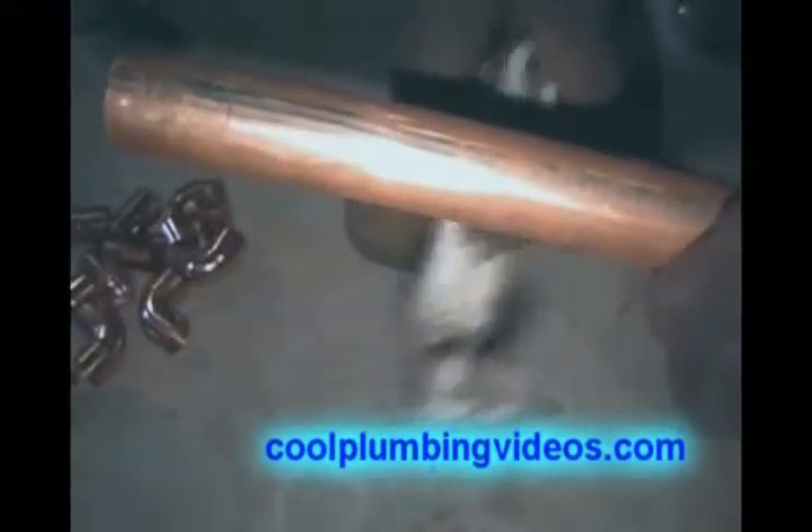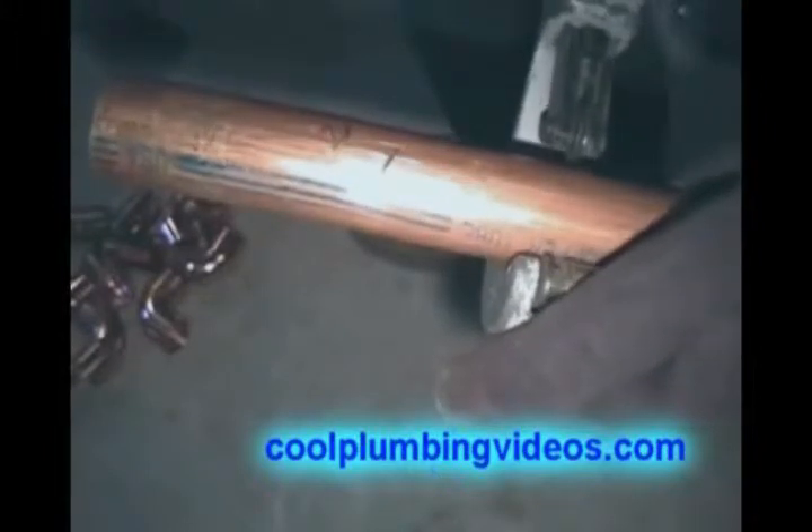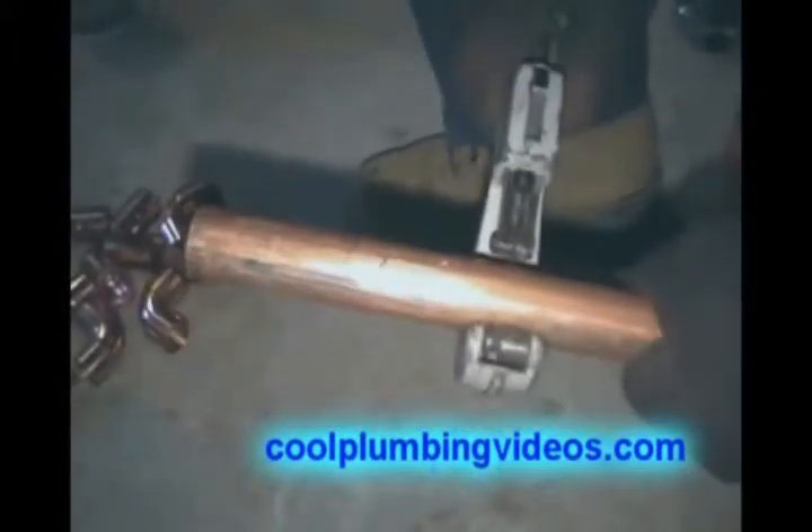What you're looking at here on the floor is a backflow valve, and what we're showing you there is a 3/4 inch male adapter. Before we put this male adapter and attach it to the backflow adapter, we're going to solder the pipe to the male adapter first. That way when we go to pipe dope the male adapter or put Teflon tape on it, we won't lose our seal reheating it up, and we won't damage the backflow preventer with any heat.